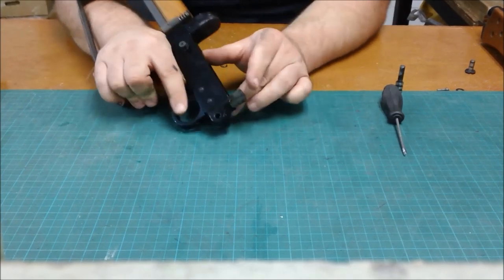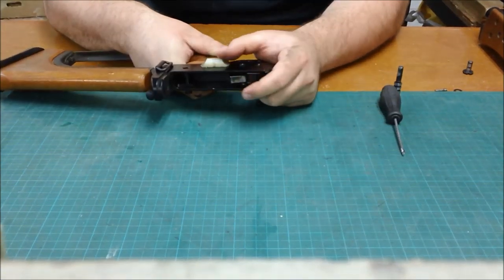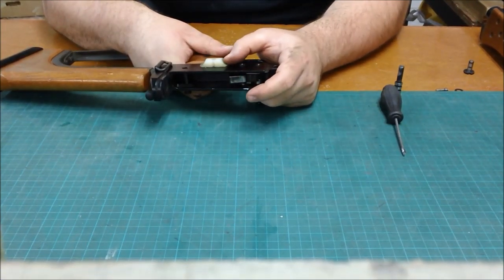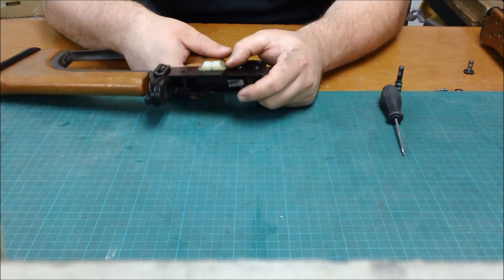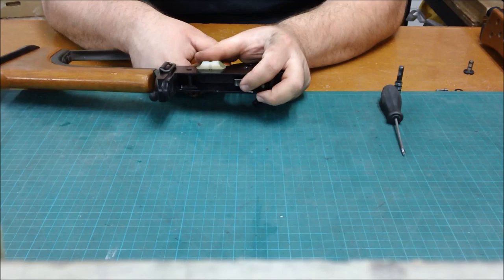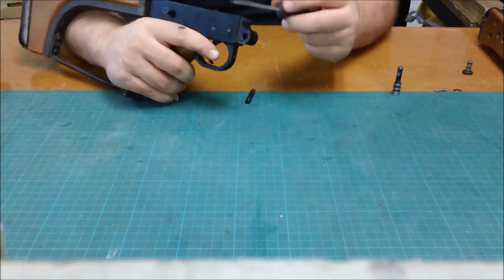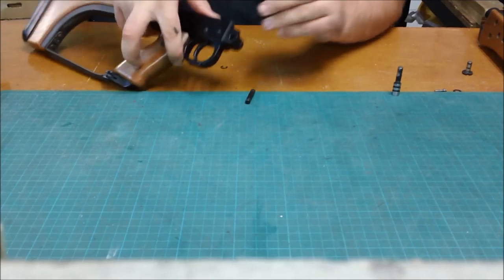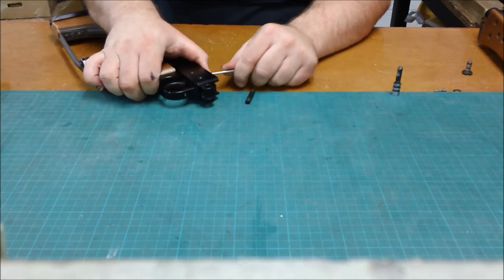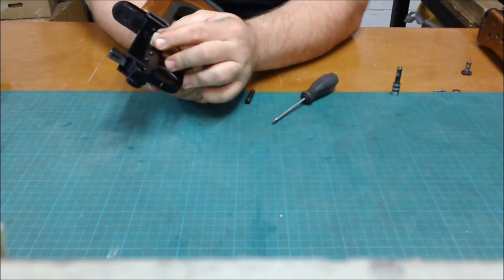He said he's seen that in other rifles. One other thing to notice is that the safety, and this is not the original safety, this is something that was made afterwards because the original safeties, I think, were all missing, can be put on safe, semi, and auto from any position, even if the hammer is forward. I'll show that in a second. Okay, safety can still be activated.